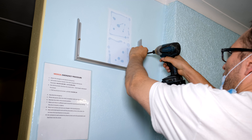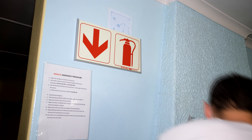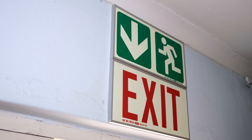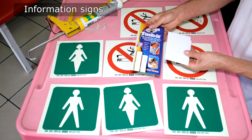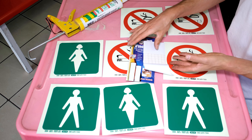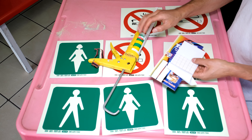For this particular brand, you slide the top off. I'm using a six-millimeter nylon plug so I'm using a six-millimeter masonry bit. I just need to tap this a little bit and then it slides in.